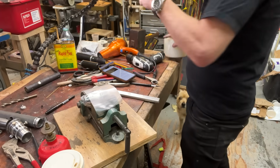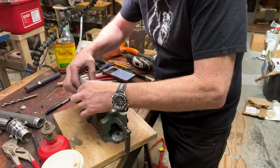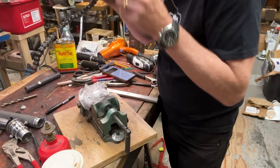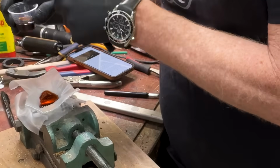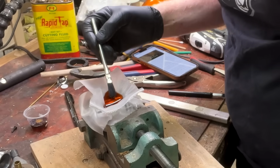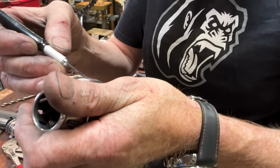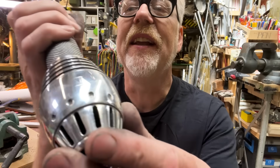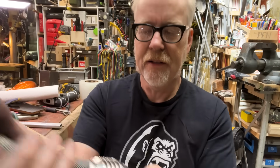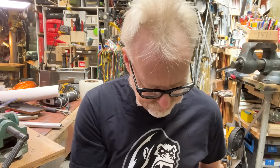I then made a little bowl around it. And this is why I like this stuff, because I can see through it. And if I was getting any leakage, I'd be able to see it. Ferric chloride was the etchant I used. That's the Weta Workshop favorite aluminum etchant. And I just did like 8.5 minutes on that rune, and then I hit it on the polisher. And I feel like it's great. I'm pretty happy with it.